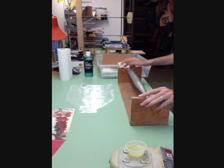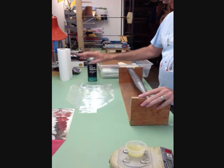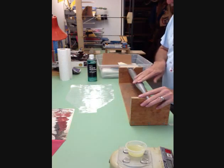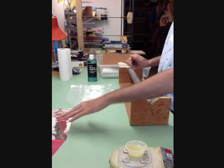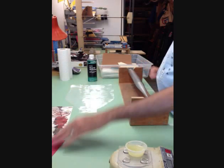I've got my supplies laid out here. I've got some mold release getting ready to go on my mandrel. I've got some half-ounce glass — this is cut so it wraps two layers around each section of the mandrel. There's nothing really magic about it; just measure your mandrel and cut out a form like that. I've got my half-mil mylar set up here to go over this section.